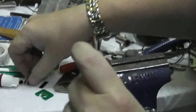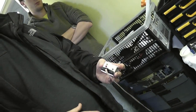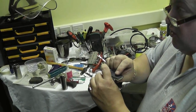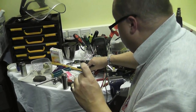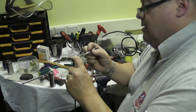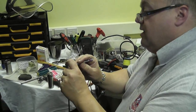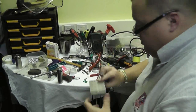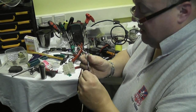Hold the handle when you're tying it up. Make sure the insulation is removed. Wires around the back of the inside guard socket - you don't want to wrap too much around because it ends up in the screw threads. The two wires have come out through the back insulation up to the screws. Make sure they're not touching the guard otherwise you're going to get some weird and wonderful lights. I tend to put the main spring in first as well. Depress the tip - I have a green light, it's functioning. Check the gauge, turn it around, press down again doing the four cardinal points - that's fine.